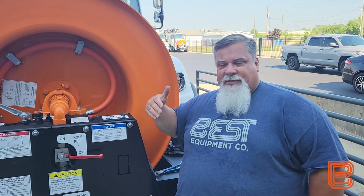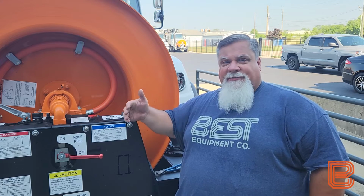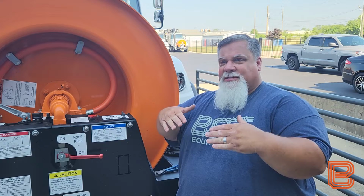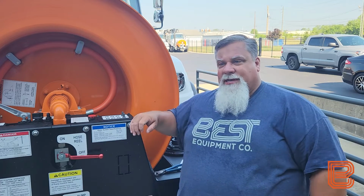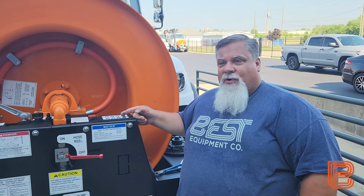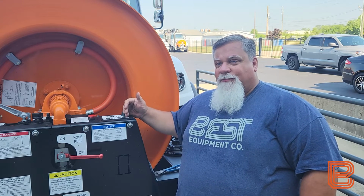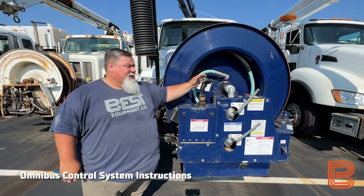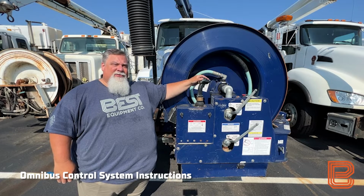All we need to do is get those cylinders moving for 10 or 15 seconds to get that water moved out of the cylinders up into the exhaust section of the head so the air can take it back to the tanks. Once we're completed, we're going to de-stroke the pump and we're ready to move on to the next process.